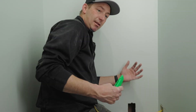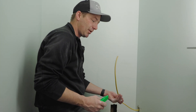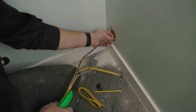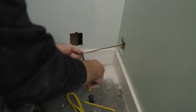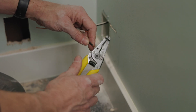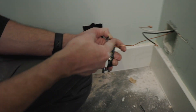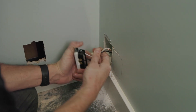You always want to make up the load side first — this is the side that is not where power is fed from. Then I'll go down and make up the panel where the breaker is; that's the line side. So I can just turn it on because I already know this side is done. You're supposed to have at least a quarter inch of insulation in there. These wires need to be at least six inches from the back of the box — I like about six inches from the front. Now I'm stripping off about an inch of insulation, which lets me put my strippers in there and make a nice little loop. You always want the wires looped around a receptacle so the screw tightens in the same direction as the loop.